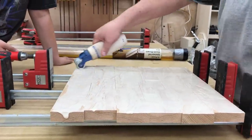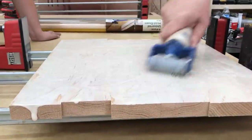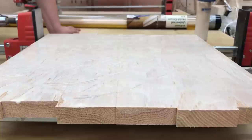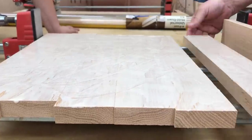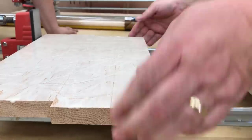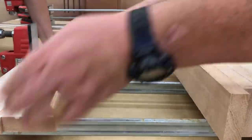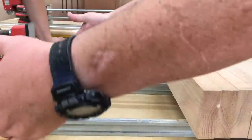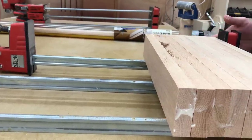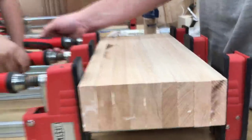The second reason, and this is pretty important, is that there was a study done in 2007 between Fine Woodworking and Case Western Reserve University. They tested different types of wood and 6 different types of glue to see what formed the strongest bond. And by far, the strongest bond created with a domestic wood was red oak with a type 1 PVA, which is what Titebond 3 is. It had more than double the breaking strength of many other combinations.